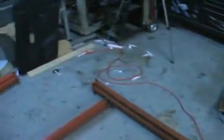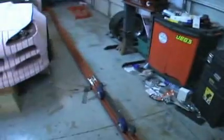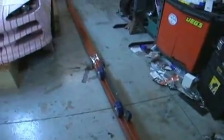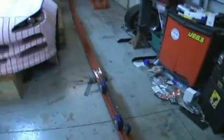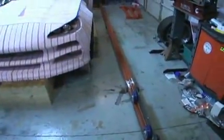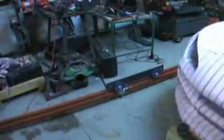And there are going to be pulleys attached to each end, along with some cabling that attaches to these little roller skates. Each pulley will basically connect each little roller skate wheel, whatever you want to call it, to each side, and make sure that when we pull on one side, the other side pulls exactly parallel. So when I move this one, the other one will move exactly the same amount on the other side.